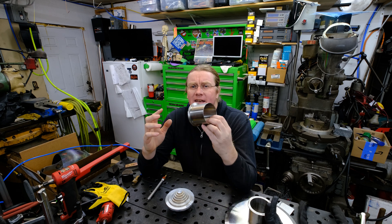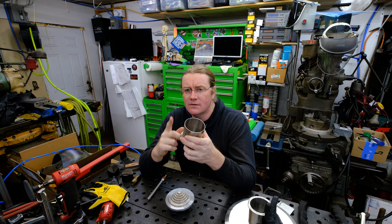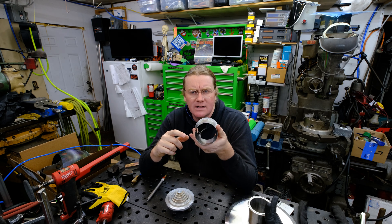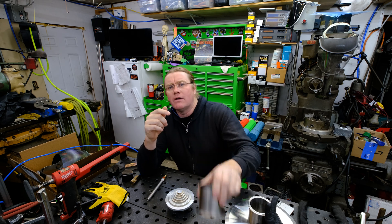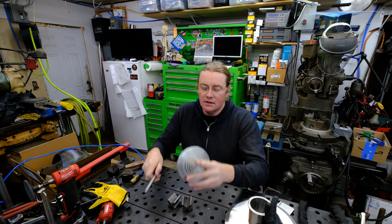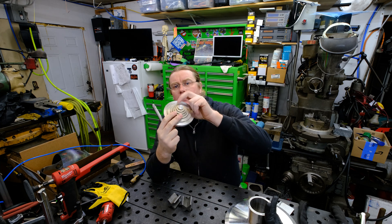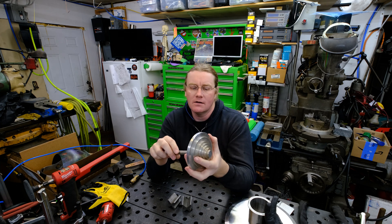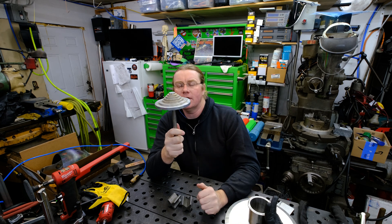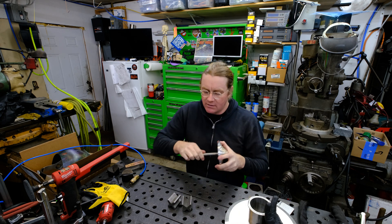These are really thin. If these were thicker, what I'd probably do is just go ahead and lightly fuse them all the way around without back purging. However, these look non-standardly thin, so I'm worried about burning through and sugaring the back side of them. I got my purge tree out — this is basically a big aluminum block with a hole milled in it that lets argon flow out the top, and I've got a piece of quarter-inch pipe that goes through there connected to an air fitting.